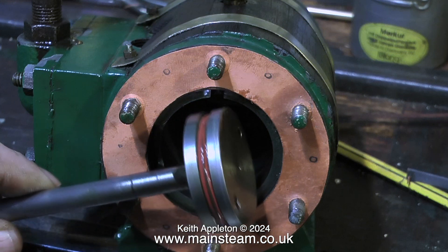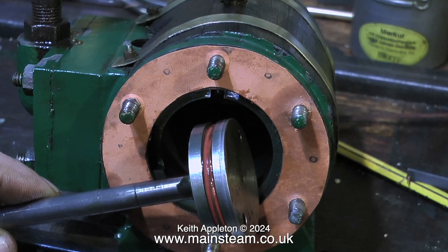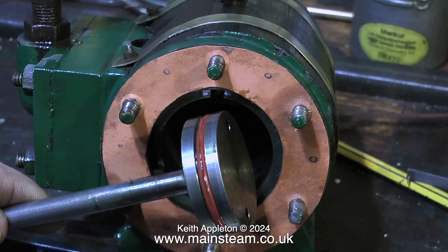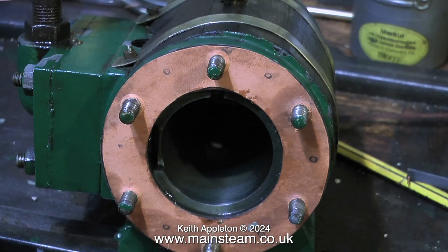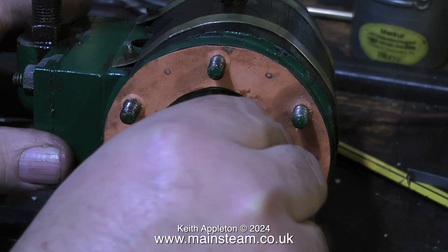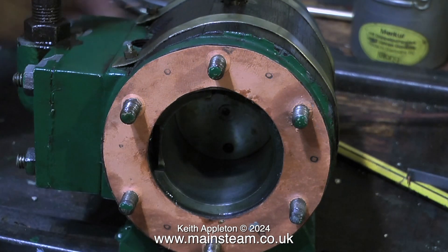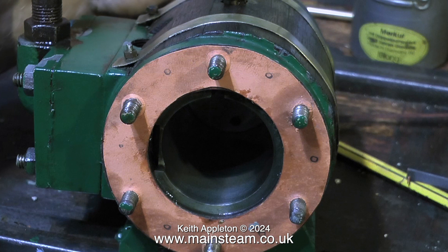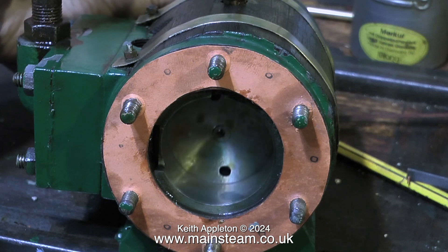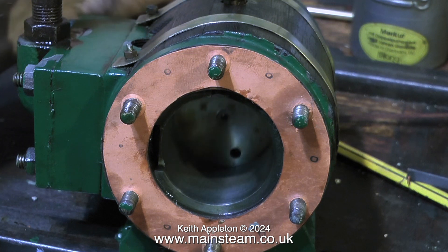This job obviously reduced the diameter of the cylinder, but it was oversized anyway. I machined the original piston to fit into the new liner, and here it is fitted with a steam grade silicone O-ring. I could have fitted a cast iron piston ring, but this will be perfectly fine. An alternative to this repair would have been to leave the cylinder alone, make a new piston altogether, and groove it to take two cast iron piston rings.